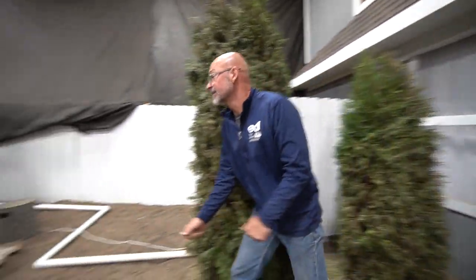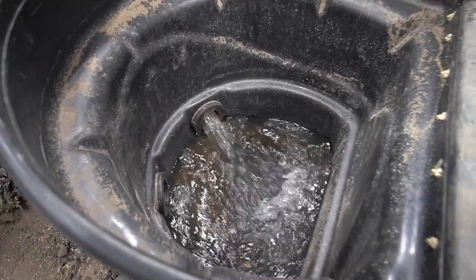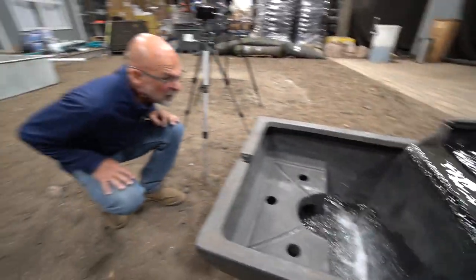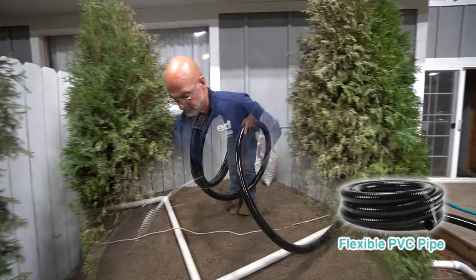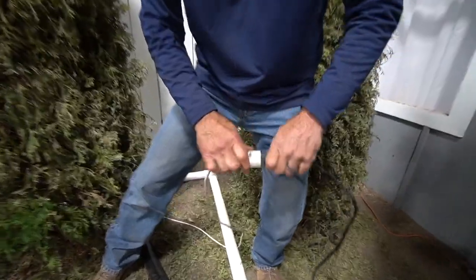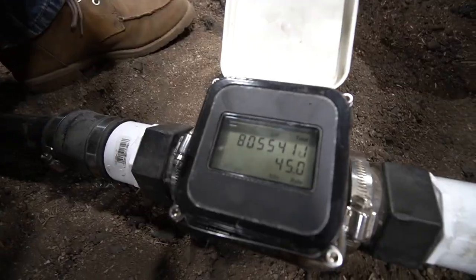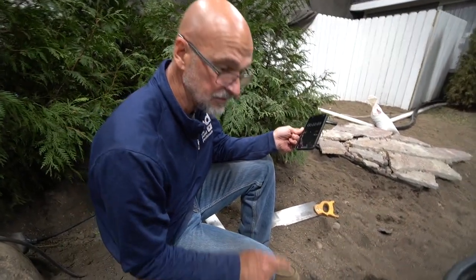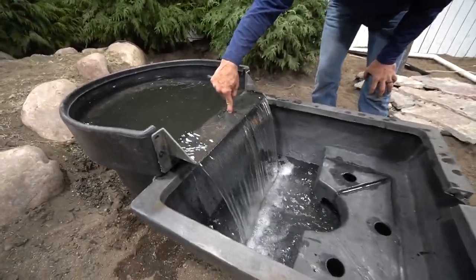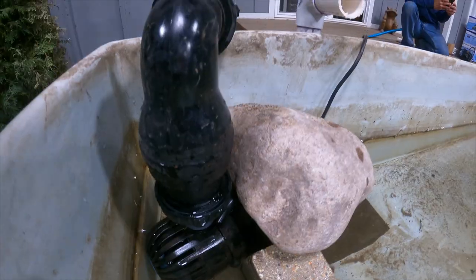All right, we are ready to test out this system — let's see what it does. I hear water. We measured 23.7. Next test — flexible PVC pipe is in place, let's plug it in. We are at twice the rate — we were at 23.7 and we are pushing 45. It's actually dropping down a little because we're getting a bit more back pressure on it, but that's significant. See the water thickness coming over — there's a better overall flow. That was a significant difference when we start talking about gallons per minute — we were actually 13.5 to 15 gallons per minute more flow just by going with the flexible PVC.